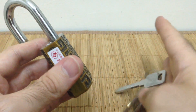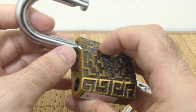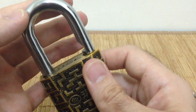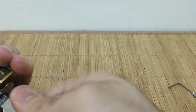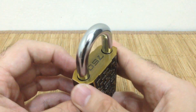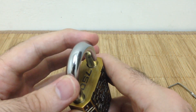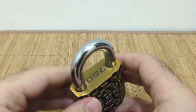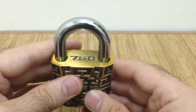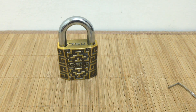One thing you'll notice looking closely is there's only one cut on the shackle, meaning there's only one locking dog, and it's clearly not a ball bearing mechanism. When I first got this lock I was a little disappointed about that, given such a cool core. And looking at the gap, it's huge — you might think this could easily be shimmed. But I found that is not the case, as it has an interesting way of preventing shimming, which I'll demonstrate in the next section.